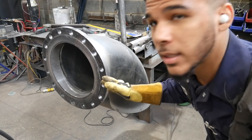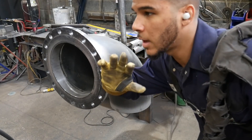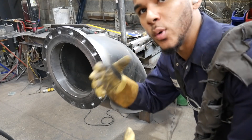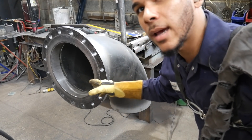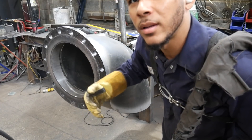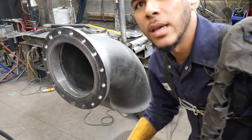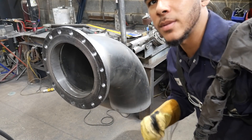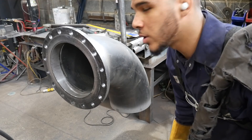Here's the first piece all packed up. I'm going to weld the root at 150 amps, doing it in two quarters to stop it from falling, and then cut out the tacks — because where it's a weld neck I want it to look nice. Then I'll do a hot pass at about 300 amps and cap it at 240–250 amps.